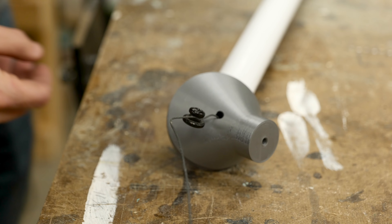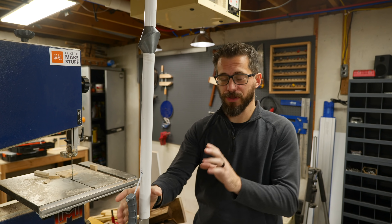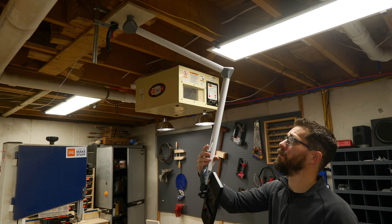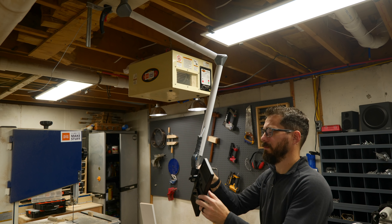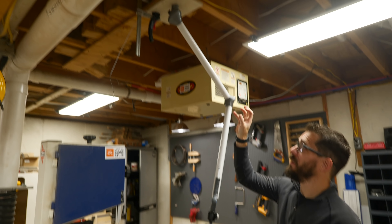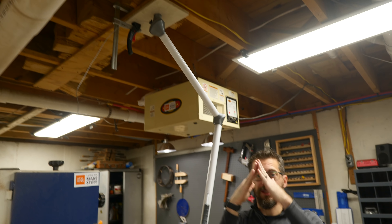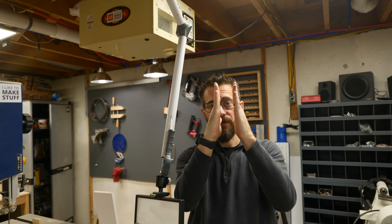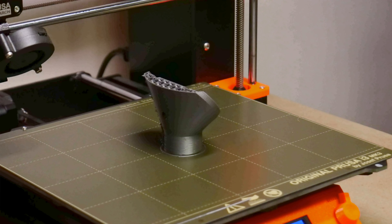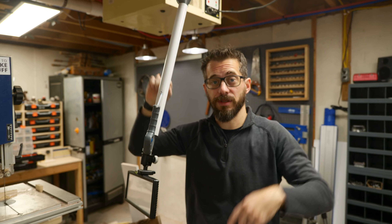We got this thing mounted to the ceiling temporarily and I want to test it out and make sure the whole mechanism works. We did play with it a little bit and it does hold in place. The joints need to be kind of rested into their slots so there is something we can adjust as far as the tension. One of the other issues is that these two pieces can separate and often pivot on the center point, so we need to put a little collar around one side of them so the other one will sit inside that collar. I've got a version of one of these pieces on the printer, and while we're waiting on that let's go ahead and work on the trolley and the track across the top.